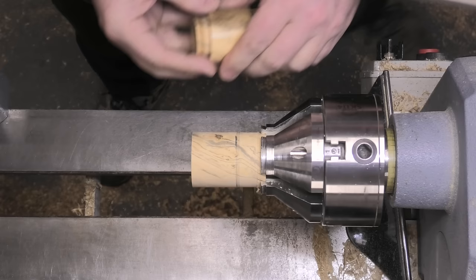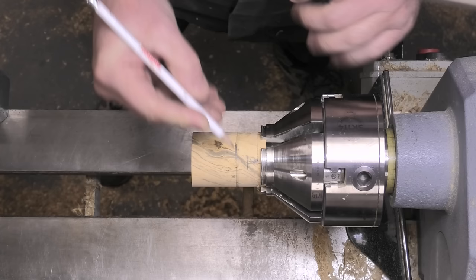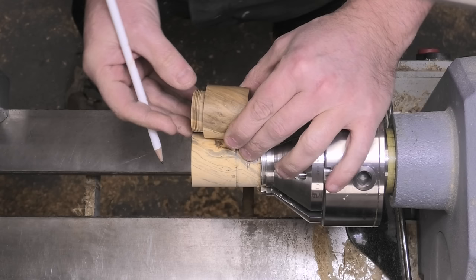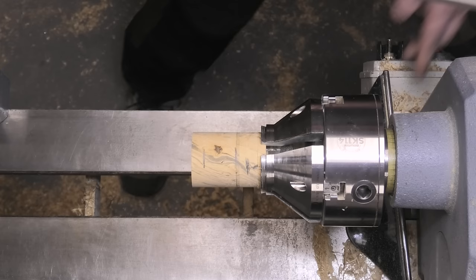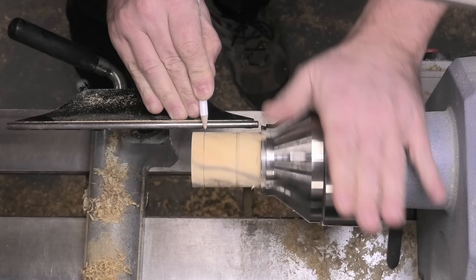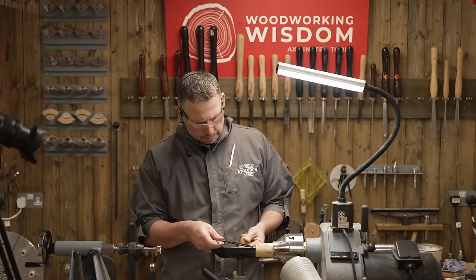There we go — this is going to be the bottom of our shaker right there. We're going to make it look like this completed one. The bottom of my hole on the inside should be there, and the actual bottom is around about that point, so we've got loads of space to part off in a moment. What I need to do now is create the male thread, so I'm going to work on the diameter as well. I'm going to cut in there with the parting tool in a moment.